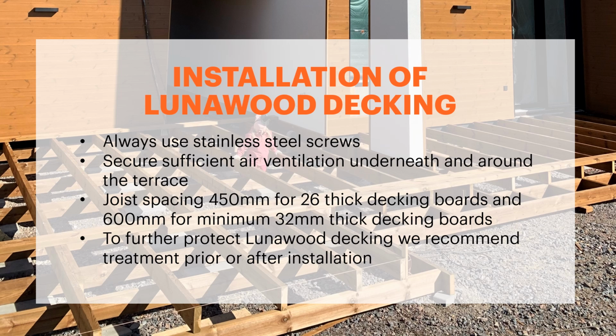Joist spacing is dependent of the thickness of the decking boards. For the decking boards with the thickness of 26 mm, we recommend the 450 mm joist spacing. And for the decking boards with a thickness of minimum 32 mm, we recommend the joist spacing of 600 mm. We recommend to use double joists under the decking extensions. For the extensions, leave minimum 5 mm gap between the ends of the boards.